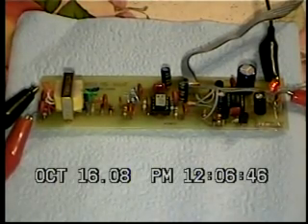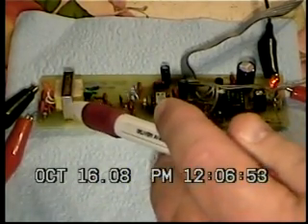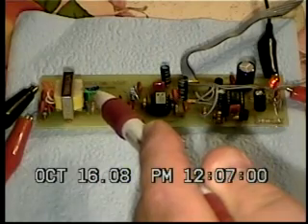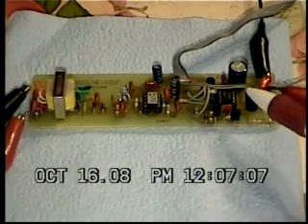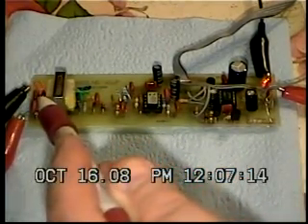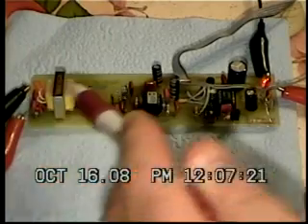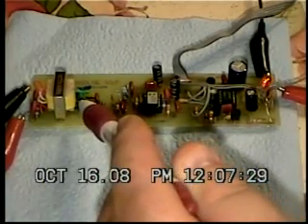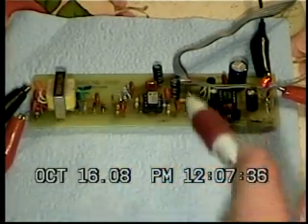The reason this unit will work with something as simple as this ridiculous 12-turn loop is because I'm using a step-up transformer to step the audio voltage up by a factor of a little over 10 times — it's an 8 ohm to 1000 ohm transformer. We have resistors and capacitors to form the static bleed-off network and the RF suppression and bypass. And in here we have the loading resistors to make sure that the transformer and loop have enough load on them to prevent ringing, which makes for a quieter sounding audio.